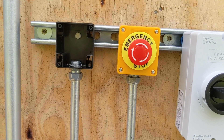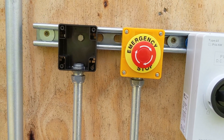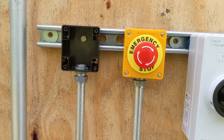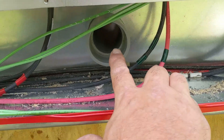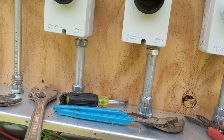There's a receiver on each panel, and then there's a transmitter, and then there's a 12-volt power supply that comes out of the solar terminal block. It's powered off the batteries and that provides the power for the coil. The solar will pass through to the inside through here. We haven't run that yet — we've just run the solar panel side of these disconnects.